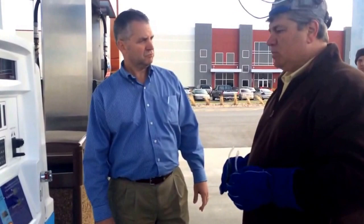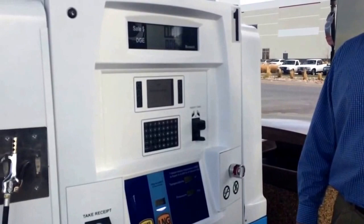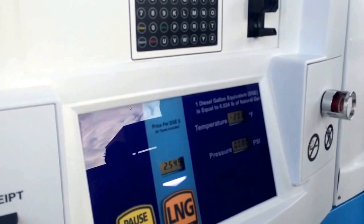You're going to always look at how fast it's dropping — that LNG is flying through the lines. That's already at negative 200. Very close. So any second now you'll see it turn. It starts putting at around negative 200 — it'll go off. It's about to start bumping. Now the liquid's going into the tank. Start watching your meter.